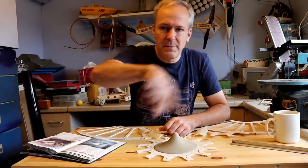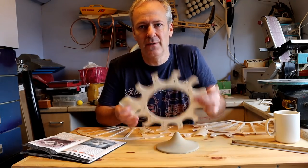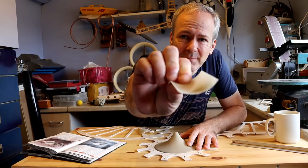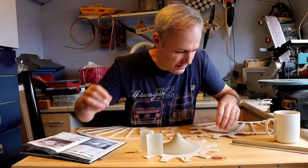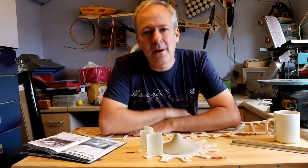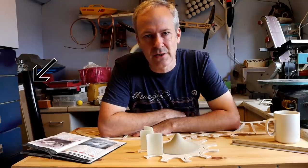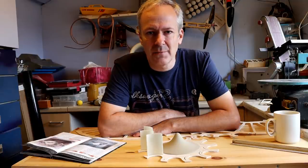But the air is also going to be spinning around this, so to stop it spinning you really want vanes. I've cut this bit of plywood with slots in which the vanes go. There are going to be 12 of those around there and that will hopefully straighten out the air. These vanes were made out of fibreglass — all I did was get a piece of drain pipe, waxed it, and then used some fibreglass to mould over the drain pipe. Then I've cut them all to size.